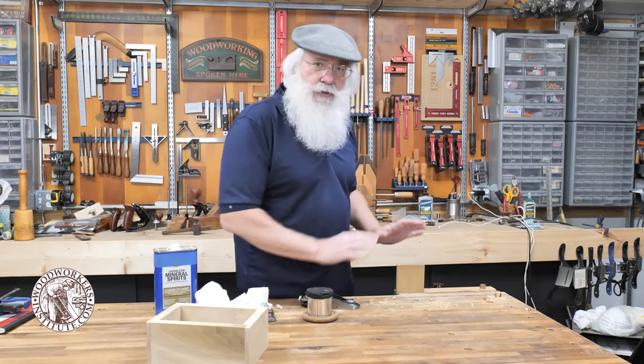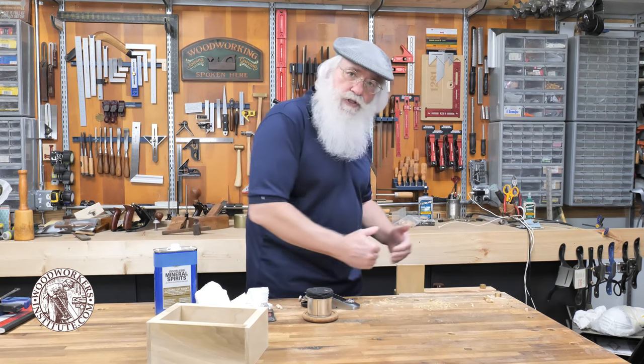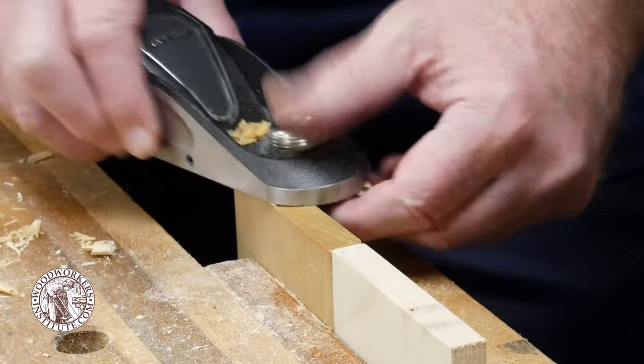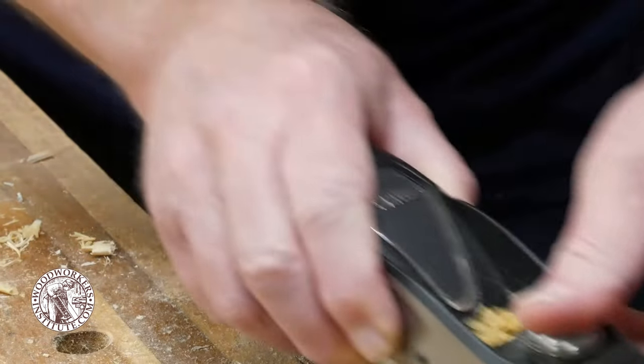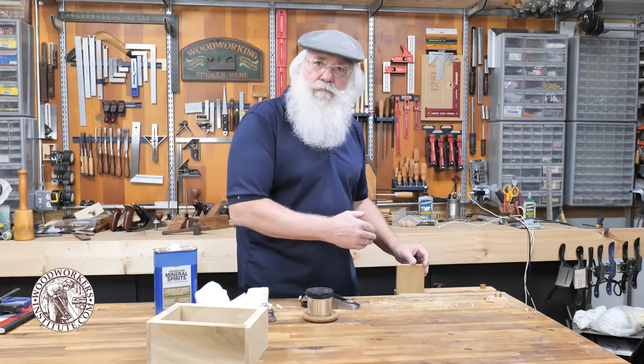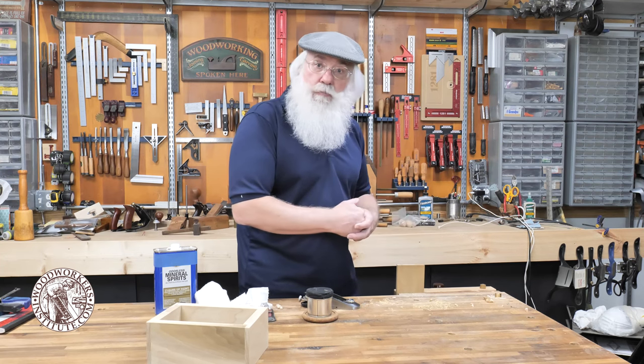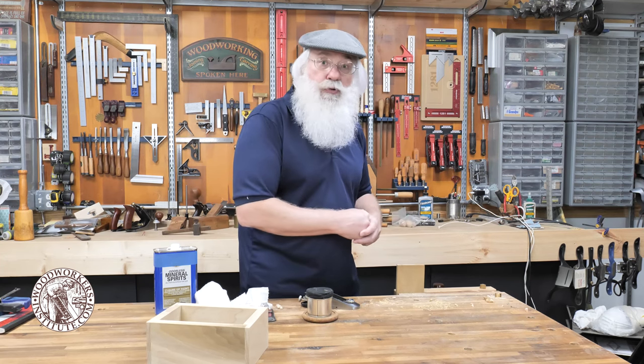I have a little difficulty with that particular method because I want to make sure that I've got one smooth stroke all the way across, so I tend to use either the backing piece method or the chamfer method to get the best results on end grain. I hope that by now you've seen some other uses for a block plane — another excuse to pull yours out, sharpen it, and put it to good use.